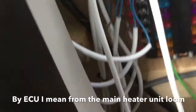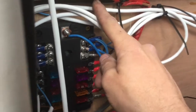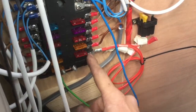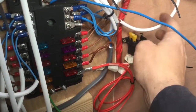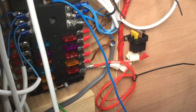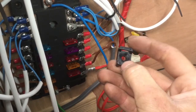So now I've got my cable running from my ECU — it just comes in from down here somewhere and shoots up right across the top. I had to split the sheath covering — really simple, just literally pulled it apart. I didn't bother using a knife; you could do, but I'm always worried I'll cut cables, so I literally just pulled it apart. Taking the negative feed, I hook that up to my negative block — all of these are negative at the top, not positive. Clip that in there, and obviously I just need to place a fuse in. This then runs through, just tidied away, to my fuse box. I think it's worth keeping two separate fuses for either of these, and I don't have space in my fuse box here for it, so all I'll do is put a combined 25-amp fuse in, and that should give me more than enough capacity.